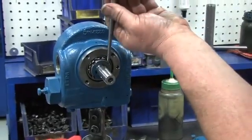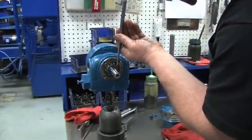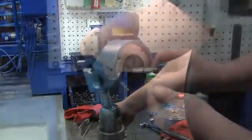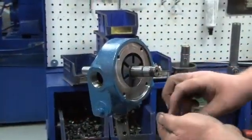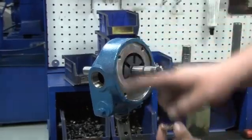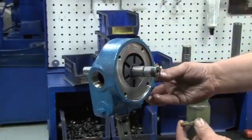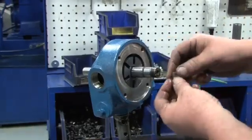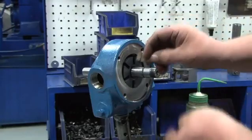Use a hammer and a punch or Blackmer's lock nut tool to tighten until you can't turn the rotor anymore. Next, install the vanes into the rotor with the open vane slot toward the valve. If installed correctly, the vane slot will be facing the discharge port, and the vane slots would be visible when looking into the discharge port.